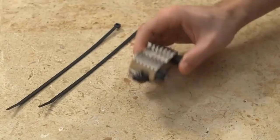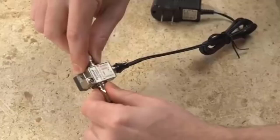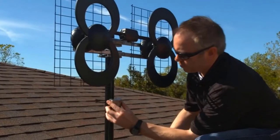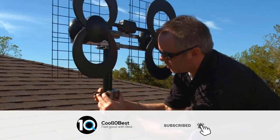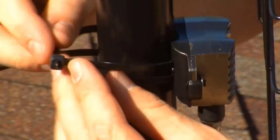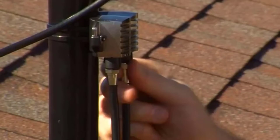The extra juice will help overcome challenges including coaxial cables over 100 feet, the use of splitters, and weak signals. Easy installation and easy to use. Includes a low-loss power inserter, 236-inch weatherproof coaxial cables, and a 12-volt DC power supply. To determine if you need a juice preamplifier, first make sure your antenna is pointed in the direction of your local broadcast towers.